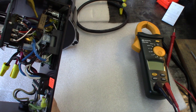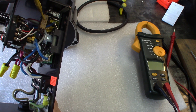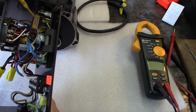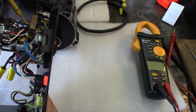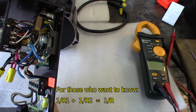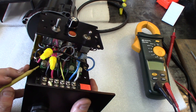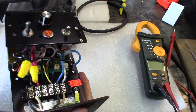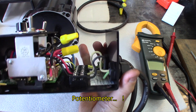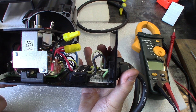There's an input fuse. This resistor here is adjustable — you put in the resistor according to the load you intend to put on the unit. I've got a quarter-horsepower motor, so I need about a 0.05 ohm resistor. This one is 0.1, but there's another in the back — put two in parallel and you divide by two, so it equals 0.05. You also have potentiometers for maximum speed and minimum speed of the motor, plus deceleration and acceleration parameters so you can ramp the motor up and down.